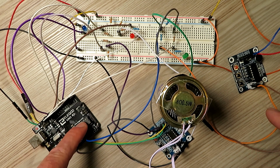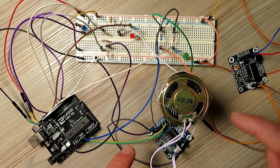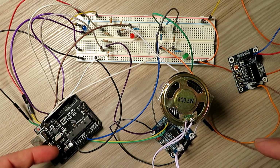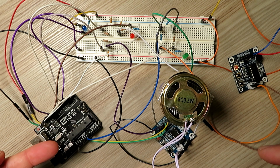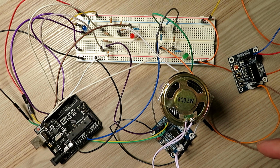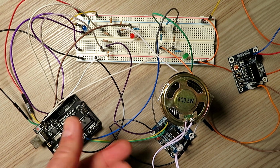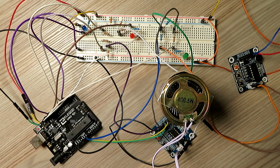The Arduino listens into the analog signal coming from the radio, and I have an adjustable threshold in the software which I can set to only trigger the PTT when it gets to a certain point, and it seems to work really well. I might have to do something with screening these cables to prevent the RF getting in. It might have to go in a die-cast box, I don't know, but I think we should be alright at the power levels I'm looking at using with this anyway.